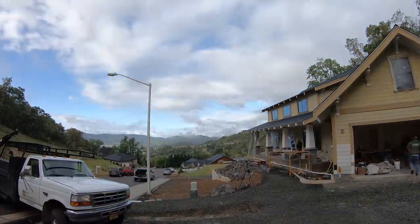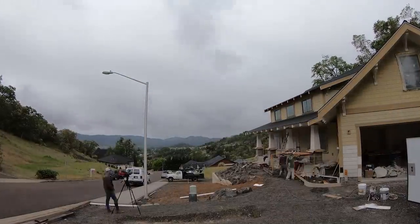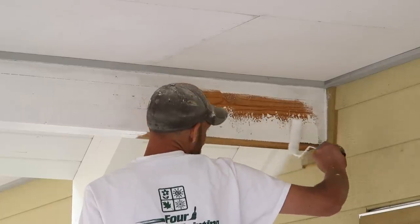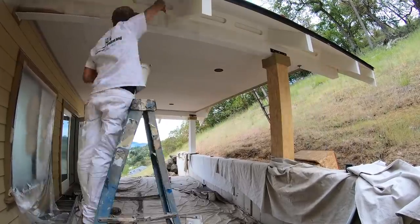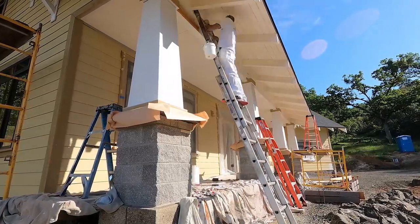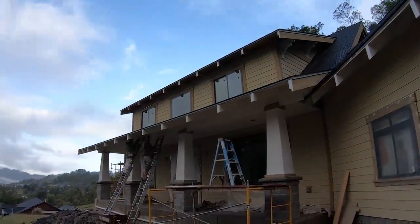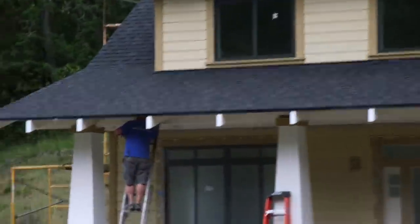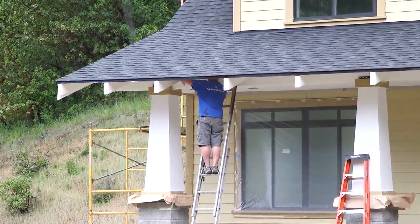Now, right off the bat, this house is not a typical or a routine house to paint at all. First of all, the elephant in the living room is, as it has always been, the details associated with the eaves and the overhangs, because they're tricky. The vents have to be protected, the raw wood has to be primed, the primer keeps the oils and tannins from bleeding through the paint, and then second, the overhangs themselves are a different color than the body of the house, and so there's a lot of masking and brushwork and protecting of other surfaces that just has to be done.